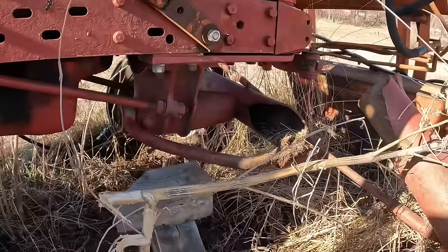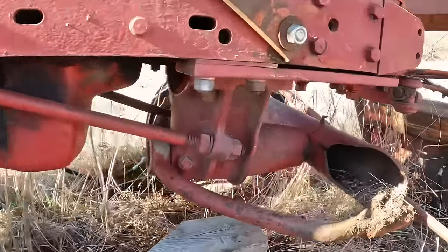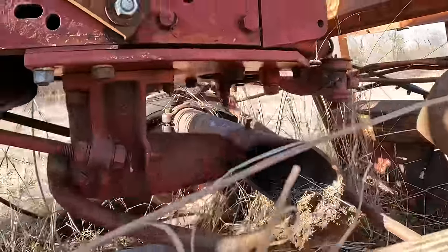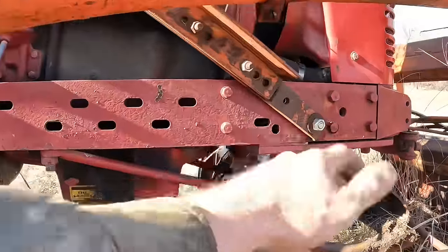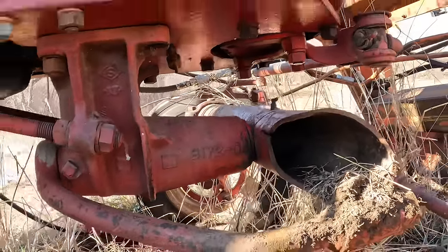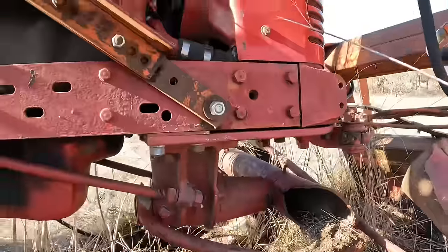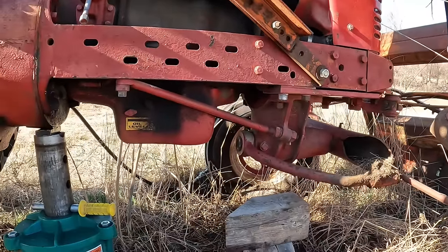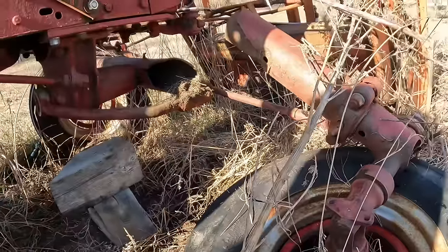So sheared off the tube right there. So looks like four bolts on this side to drop. No, one, two, three. Yeah, four bolts on this side, four bolts on that side to drop the axle assembly down, then three on the steering up there. And then we'll get my narrow front underneath it. This is kind of what we're after here. So we'll see how this goes. Looks like I need impact and a 15/16, and we'll start tearing this sucker apart. Good news is I got a loader when I'm done to grab this and get it up on the trailer.